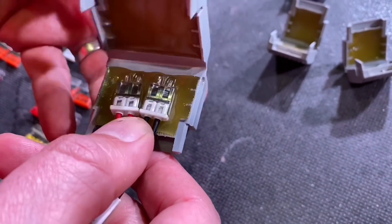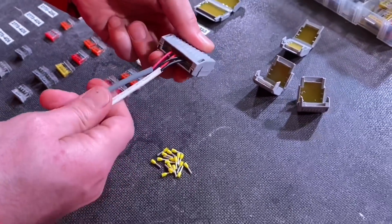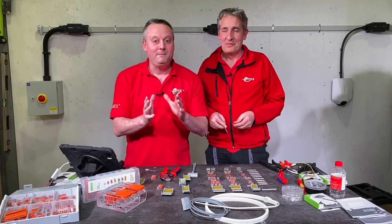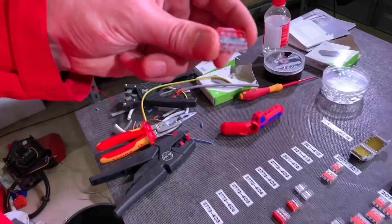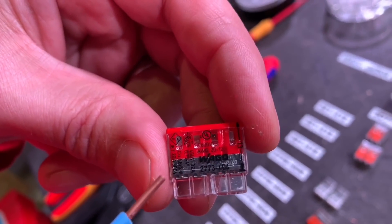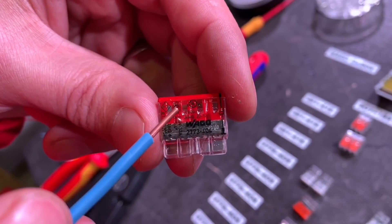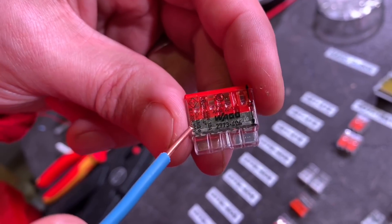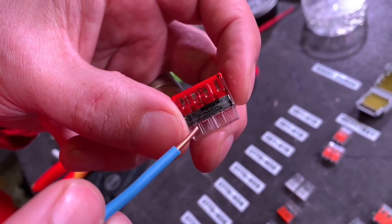Prepare them, put them into the connectors, push them into place, click the lid shut — and that's our outdoor LED system protected to IPX8, running at 24 volts, so as an SELV system we don't need to worry about another enclosure. Let's check out some of the details on the 2773 connector, as there are a lot of markings that can confuse people, particularly around current ratings. The approvals include UL for the US, ENEC for Europe, and PSE for Japan. Japan has a completely different current rating to the rest of the world to fit their electrical system.